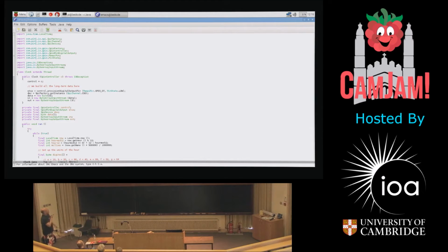You think about it, we've got the 3 lots of 7 segments, so that's 21 bits. We've also got 3 bits spare, like hurrah! So I've used the 3 bits spare for our hours: one to control the flashing colon in the middle, and I've got 1 spare at the moment, which I might use as an AM/PM indicator, but generally you look out the window, it's a bit easier. Frankly, if you've lost track of AM and PM, you're beyond my help.